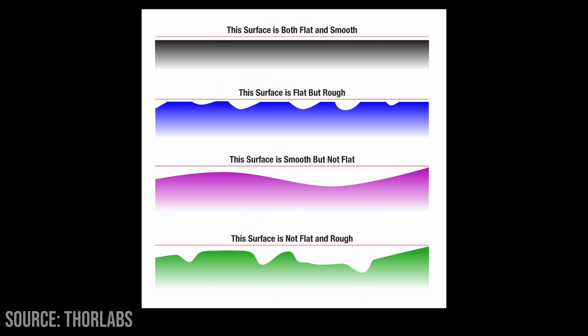Now is probably a good time to pause and talk about the difference between flatness and roughness. I've been kind of treating them the same — saying flat or smooth or flat and rough — and at this scale that's mostly true. When you're looking at a 10 by 10 micron area they're pretty equivalent. But in optics and the macro world that we live in, flatness and smoothness are very different properties.